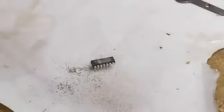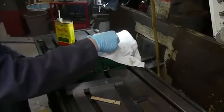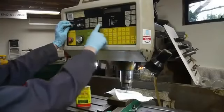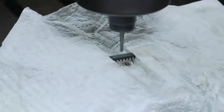For my first real attempt, after playing around a little bit with the Dremel, I decided to use the CNC mill. I drew up a little pocket in the CAD tool, then mounted the IC in the CNC vise, got it carefully set up, and then milled the pocket out. So I had a really nice, even, consistent depth pocket.